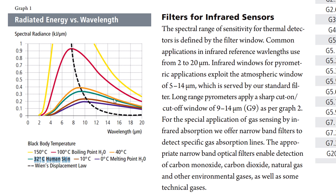So the infrared filter you use to get a narrow band of energy into your sensor is important, because you can't just have it detecting all wavelengths of radiation — otherwise you'd be getting noise caused by all sorts of stuff. You want an infrared filter on the front to get a narrow band that detects human movement. That infrared filter is also critical to the white light immunity, because you don't want the sensor picking up white light coming in through the window from the sun. If you set your alarm, left a window open without closing the curtains, as the sun moves across the sky it might trigger the alarm at 2pm every day — it'd be hopeless.